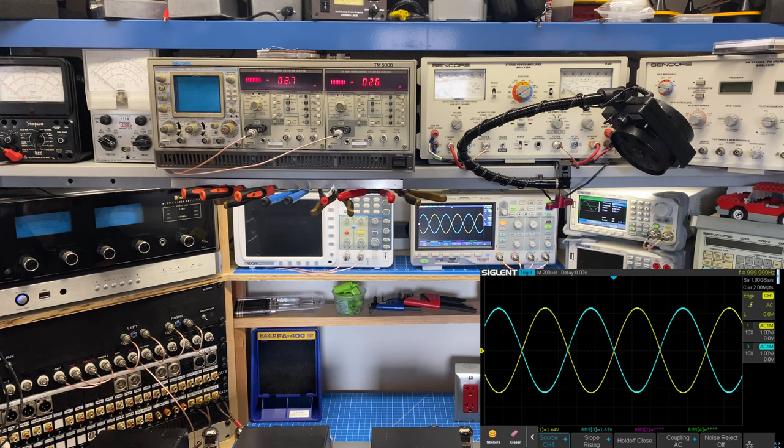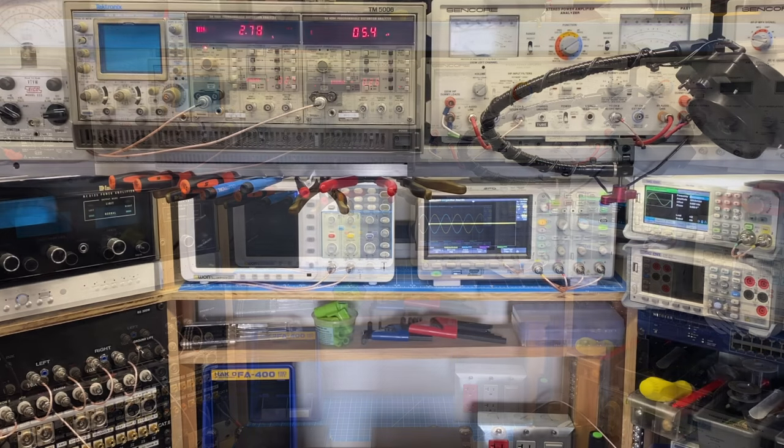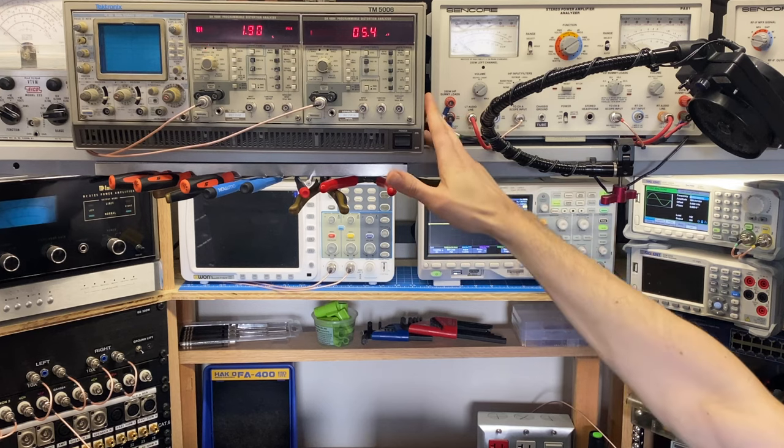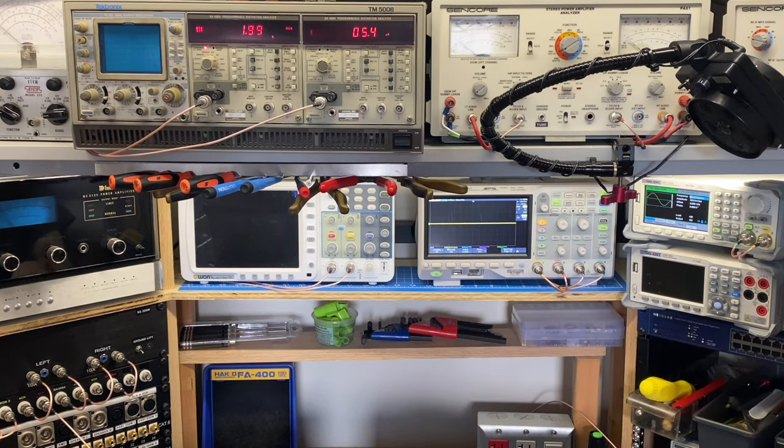All right, next we'll move on to some THD measurements, and for that I need to hook up my low distortion Tektronix oscillator. Okay, so this final test is going to be testing THD plus N at rated power. Now, my setup here is for testing stereo amplifiers with a shared ground in the same chassis, so it hasn't been working very well testing both mono blocks at the same time. The results are not accurate, so I'm just going to show the left channel by itself here.